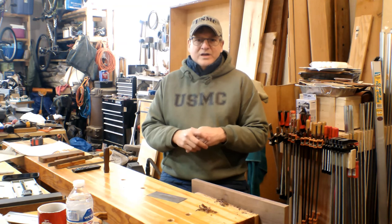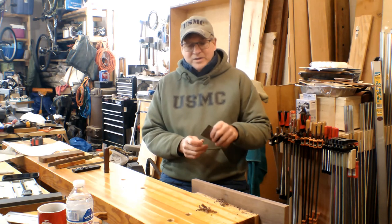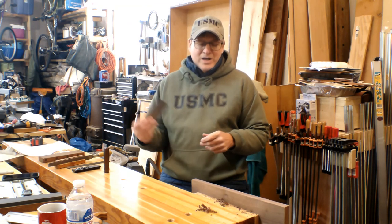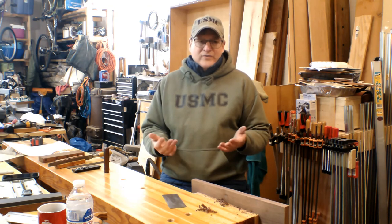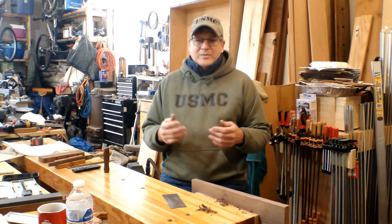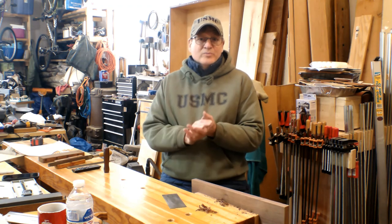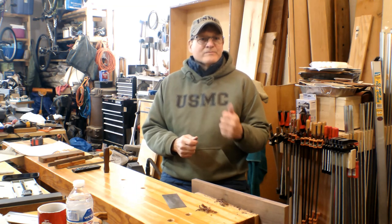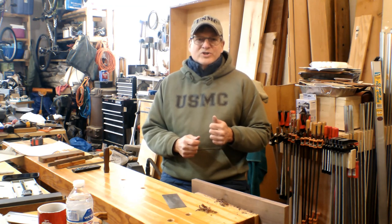There are tons of different things you can use these for. If you butt two pieces of wood together and glue it, this thing will take off squeeze-out bubbles or glue lines really quick. If you're a few thousandths high on one side, pick this up — you don't need a plane — just pick up a card scraper and scrape it off. It's also great for scraping off paint or gunk. I buy pre-cut turning blanks at the store and they'll usually come coated and waxed — great for taking the wax off in a couple of minutes. So, tons of different things you can use — it's the problem solver; it should be in your toolbox. Get two of them. Sand-Vik is the one I personally recommend. Learn to use it, learn to sharpen it, and thanks for joining me today at 30 Minute Woodshop.